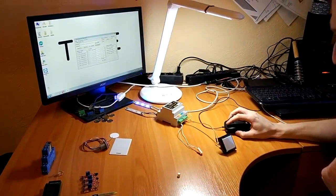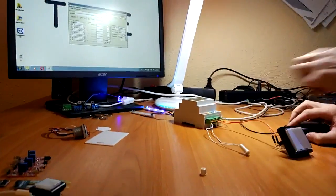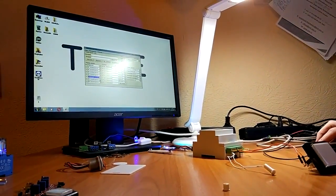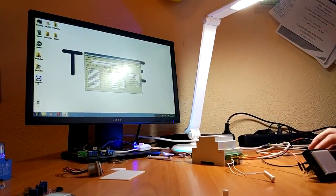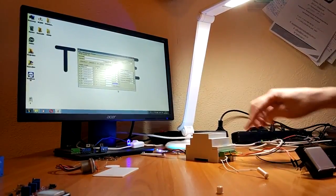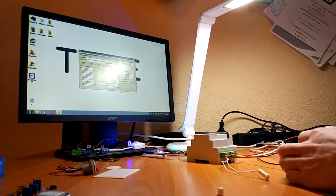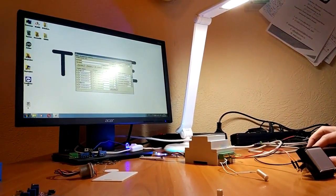For this purpose, we connect the sensor input and output groups. Then select the input mode, in this case input number 5. The signal is digital. We continue to press the button to record input signals. After the signal is recorded, we must write the condition. In this case, condition number 5, because it corresponds to output number 5. Set the input tick under number 5 and click the button Set Value.